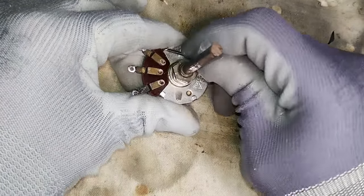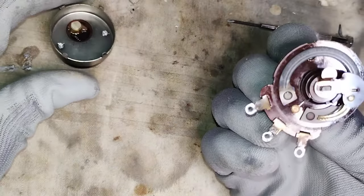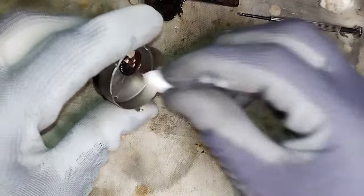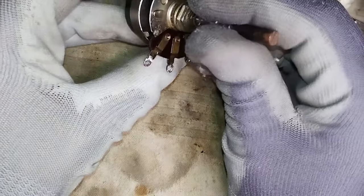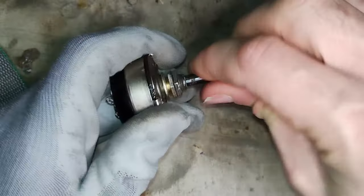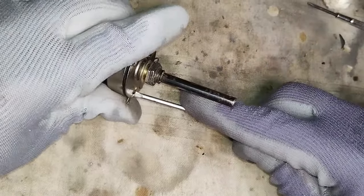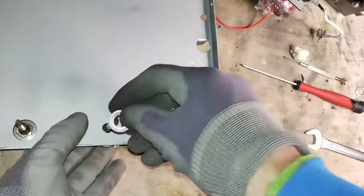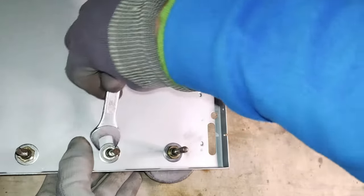The radio has two potentiometers, one for the volume control, the other one for switching the radio on and off. That very likely was meant to be a tone control. However, at its initial condition before the restoration, the tone function was completely missing in the radio. The two potentiometers are inspected, cleaned and mounted again, directly on the front panel. Later, the tone control function is re-enabled in the radio.